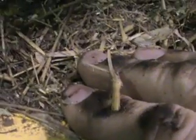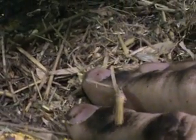First thing, drop your belly pan so that way you can clean out all the crud that's accumulated. Because if you don't clean it out, what's going to happen? The crap is going to keep vibrating around, eventually wear a hole in your plastic fuel tank. That'll cost you some big coinage. It can also, believe it or not, wear a hole in your metal oil pan. So that'll cost you some money too. So some cheap maintenance tips.